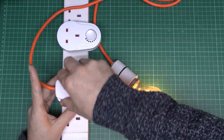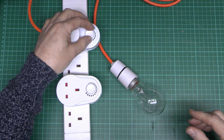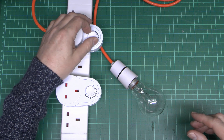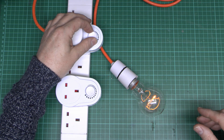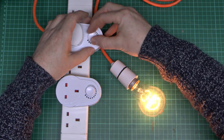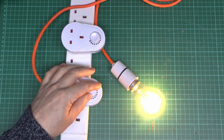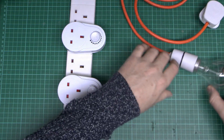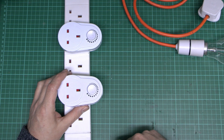So if they are faulty, they're not as faulty as you would expect. The second one has a bit less dead space on it, but there's certainly dead space at the bottom. This is probably a Triac-type dimmer — when you turn it up there's a minimum point where it will actually strike, and once you've got there you can actually turn it down below that point. It appears these are not entirely faulty; they seem to be working perfectly, at least with this type of lamp. As noted earlier, these are quite likely not going to work with LEDs unless they're designed to be dimmable, otherwise all kinds of bizarre stuff can happen. But they certainly do appear to be working.